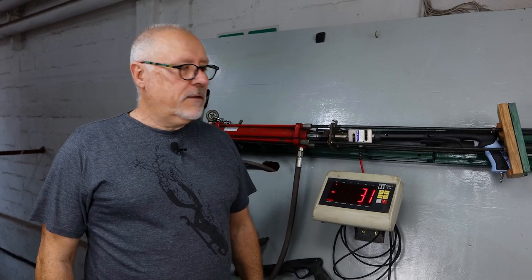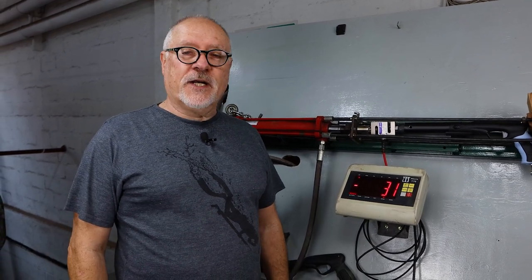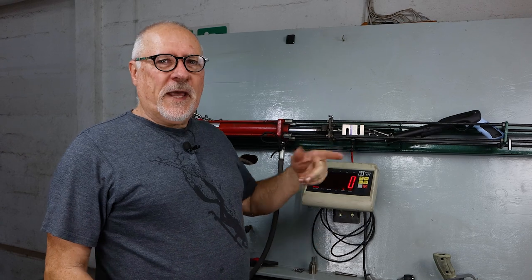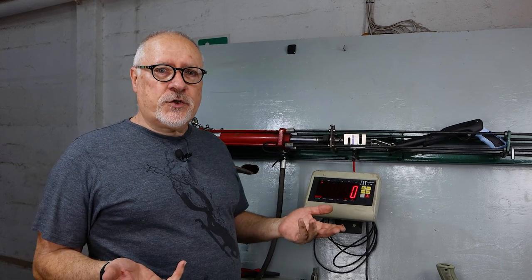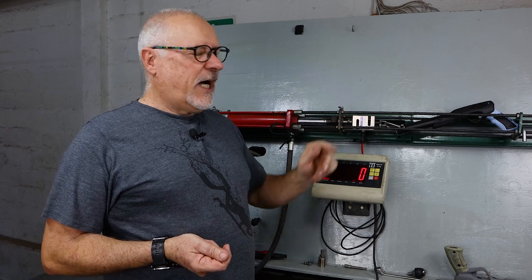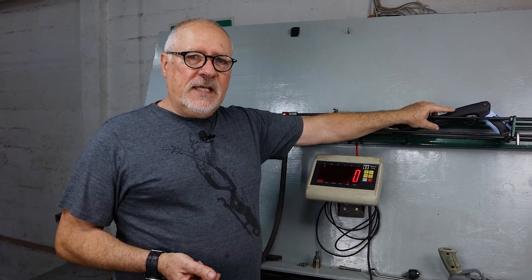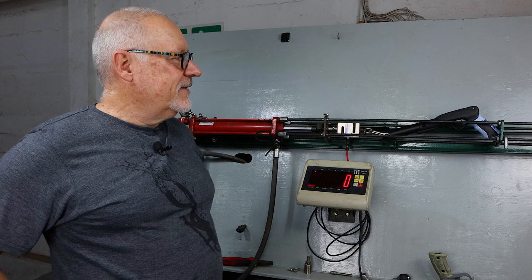This one performed well. We're going to do multiple more tests off-camera just to be 100% certain before we go back into production. Bonus — we forgot to test this specific material in tension. As explained before, when we broke them last time in tension it handled about 280 kilos. That's not something you can normally pull, but occasionally a large reef fish takes your gear into the reef, you tie it off the boat and haul on it. The older handles broke at 280. Worth noting: freshly molded nylon needs to absorb moisture, so it can be a little more brittle straight out of the molding machine.